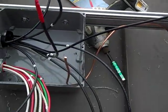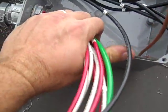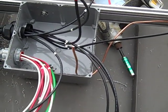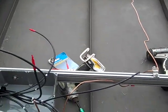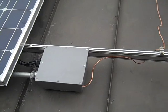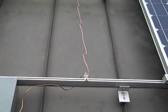About to put the last panel in, but first we need to finish up the combiner box. You've got four sets of strings coming in from the panels, then running number 10 wire down to the solar disconnect — you have to have a disconnect for the power company. Once these connections are made and the ground is put in place, we'll plug in the last panel. The combiner box is now buttoned up, everything tested for polarity on the strings, and we're about to set the last panel.